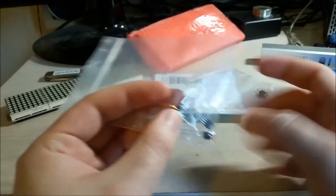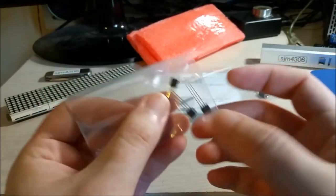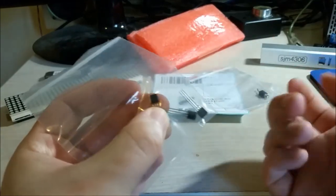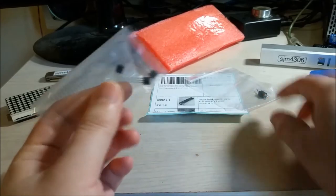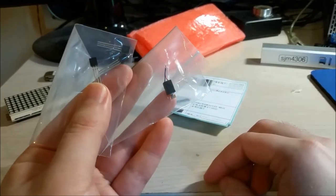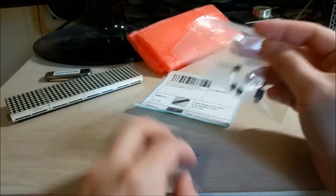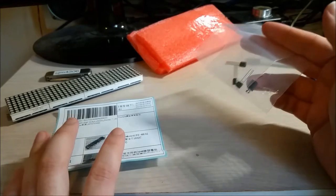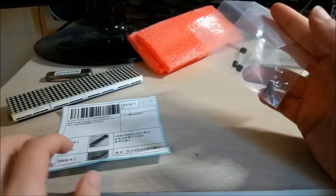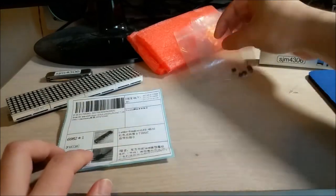I also have a handful of transistors to drive this — I was thinking of making a discrete H-bridge solution using a whole bunch of these. These are 2N2222 transistors, just standard small signal transistors. These are rated at 200 milliamps each, and this motor probably pulls like 50 milliamps, if that. So once I get a single pixel prototype working, I'll look into buying a whole bunch more of these and making a large-scale mechanical digital clock. Look forward to that.